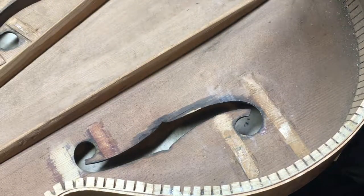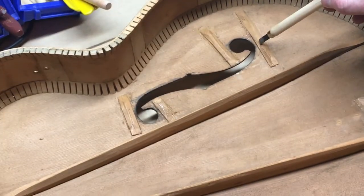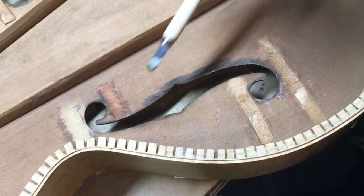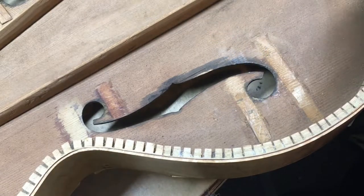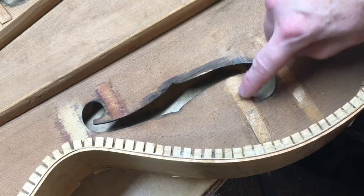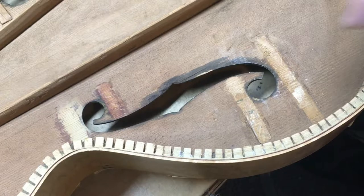Here's where I am. This is actually the bass side of the guitar and these braces are fine - one, two, three, four - those are fine. The ones on the other side I showed you in one of the other videos where I took my thin palette knife and went right under there and these just popped right off - they were super loose. In fact one of them was even broken, but it's going to glue back fine. I don't need to carve a new one. What I want to show you is how I'm removing the old glue that has to come off before I can re-glue these braces.